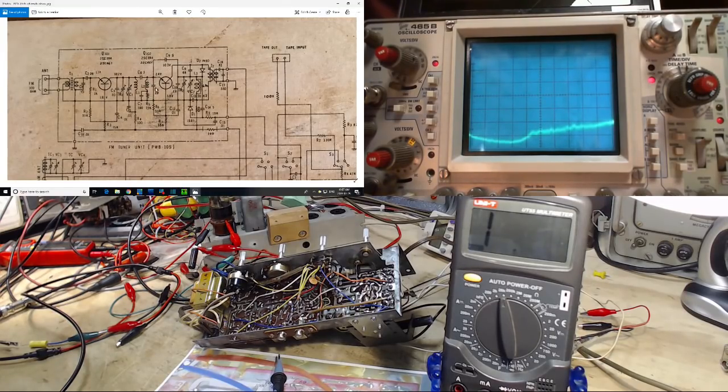So, you know, it's really suspicious. How can I be suspicious? I'm measuring 7,000 ohms. How do you get 7,000 ohms? There's 100, 15K. Is 15 in parallel with something? 15 and 33 in parallel give you 7,000. 7,000 through a leaky capacitor. 7,000 ohms. How do you get a zero here when you have a 7,000 ohm resistance to ground?